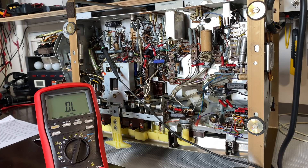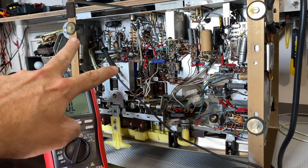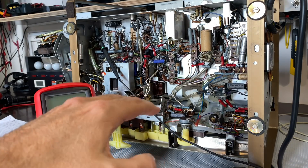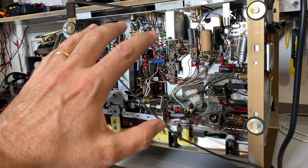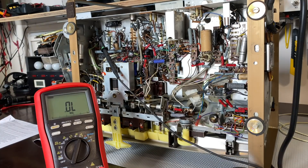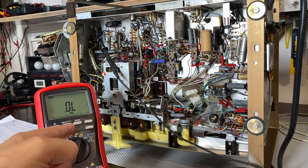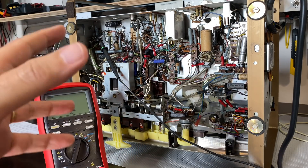As I said at the end of the last video, the first thing I do is check the power supply lines. In other words, I check whether the power that's been regenerated across the three filter caps that I've replaced — which is really the B-pluses — is getting to where it's supposed to be. I tend to call them B1+, B2+, and B3+. Now you can check this in two ways. One way is you just plug this in, like we've done. Nothing blew up, the house is still standing, and there's been no smoke. We could simply plug it in, set this thing on volts, and measure between ground, the chassis, and the various points where you should have some high-ish voltage.